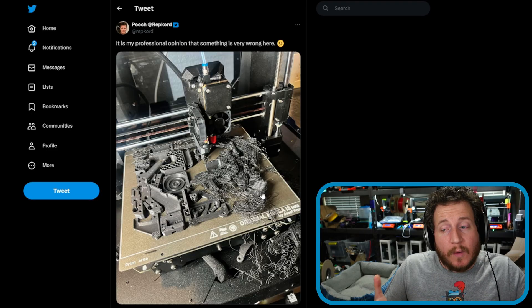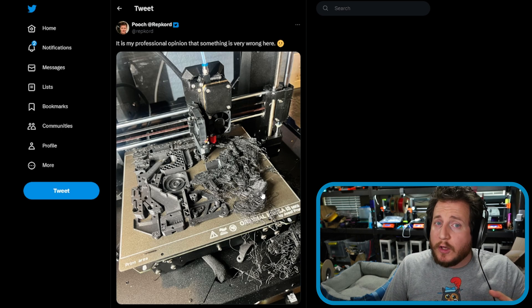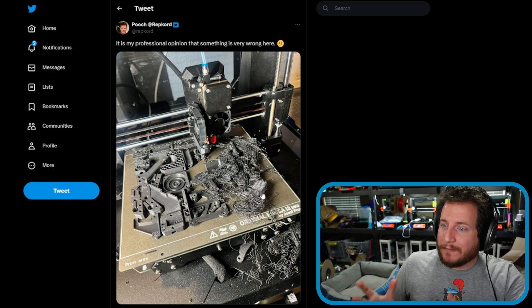Things that you can do here is look at adjusting your Z offset. And you might say, 'Grant, it's a Mark IV, you can't adjust the Z offset.' You're wrong — you can adjust the Z offset. You just have to hit and hold the main button on the screen. Not the reset button. But if you hit and hold the main button, it will come up with your Z offset. Sometimes, especially for textured build plates, you want to be a little bit closer than what a load cell would traditionally want. A load cell wants that perfectly flat glass-first layer, but for textured build plates you want that plastic to really get in and bite into those bits of texture. That's where having special profiles for textured build plates can be useful, with a little bit of negative Z offset built right into the profile. Is it that big of a deal? No — for some it works really well, for others it doesn't.